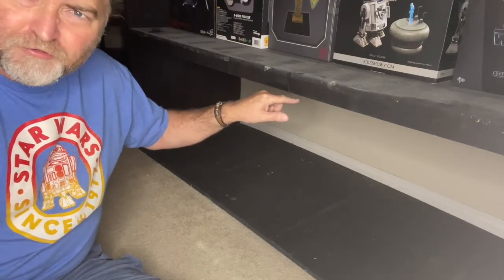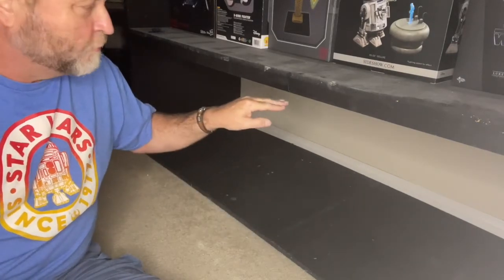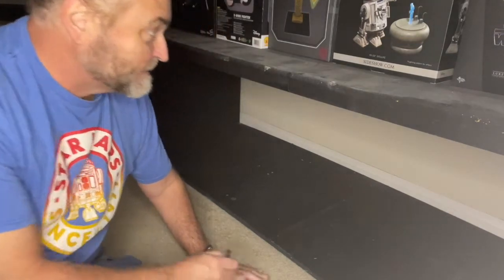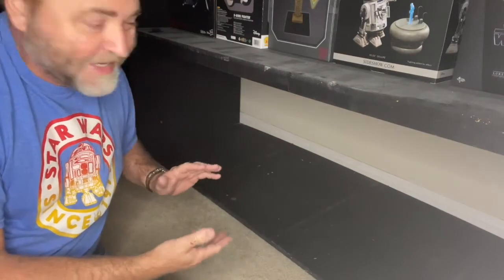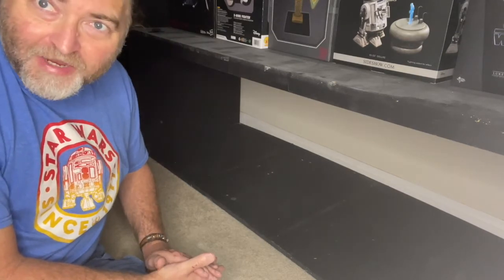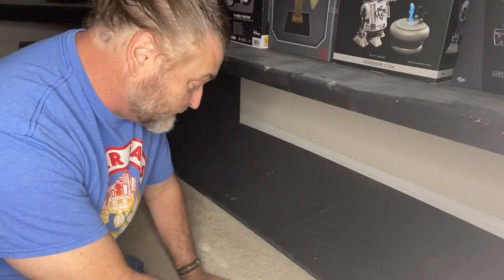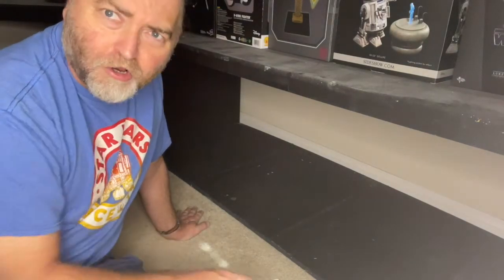The measurement I've got is two feet deep. Always write down each of the dimensions as you go. It is 4 foot 11 inches long, and the height is 19 and a quarter inches. I want to give myself a little room to move things in, so I'm going to take it down about a quarter of an inch on the side and a quarter of an inch on the top — so the height will be 19 inches. This allows the freedom to slide anything I build in here without it getting stuck or wedged, which is always a big concern.